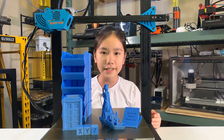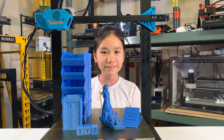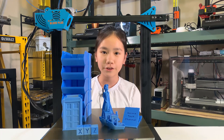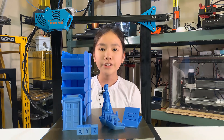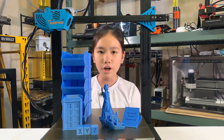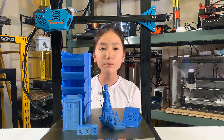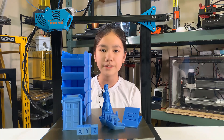You can replace the stock MKS firmware with Marlin, just like what I did to my Sapphire Plus. I want to give two suggestions to 2Trees. First, I think they should consider putting Marlin firmware on their website. For a graphical interface, the MKS-modified Marlin isn't that bad, but many users might prefer a highly customizable and stable classic Marlin firmware. Second, they could make it a direct drive, as a direct drive won't cost more than the Bowden tube setup. If I see the next version of the Bluer Plus having the same or more features with a direct drive and optional Marlin firmware, still priced at around $350, I would consider it the best choice in the same class.